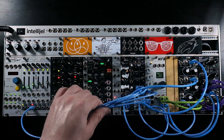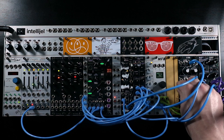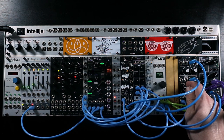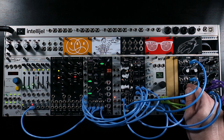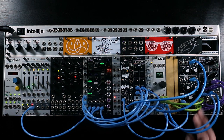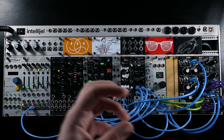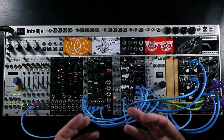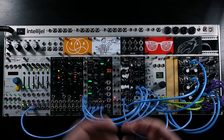And I've also got my octave oscillator here on this one, which again is going to be somewhat related because it's going to be a division of what's going on the carrier. So we've got these complex interactions, but because the ratio and the octave oscillator are related in terms of their frequency to the carrier, they're all going to kind of interact with each other in interesting ways.